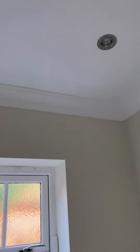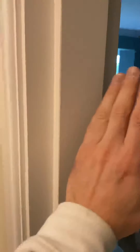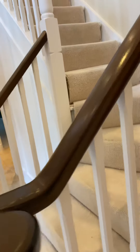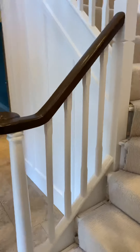I just roll the ceiling here because there's so much to mask and it's a bit more work. I just paint the ceiling windows by hand. All the frame I spray externally, just kind of half. I apply three coats on the banister itself — gloss, water-based gloss, water base. Three coats, that will do.